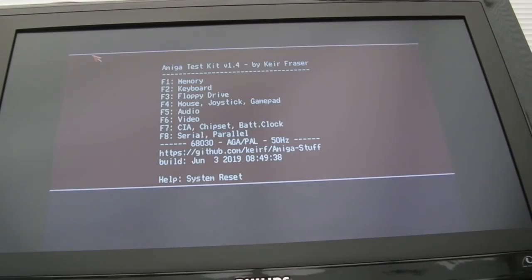We can try just changing the CPU card over again. Let me just do that, because that's the one that hasn't been recapped. And I've noticed that wouldn't work at all to start with, whereas the one that has been recapped just worked instantly. It came straight up with a green screen with no SIM, and then I put the SIM in and it booted. Yeah, and look, that's booting now, isn't it? There we go. So they did need recapping. I targeted the right thing first there.